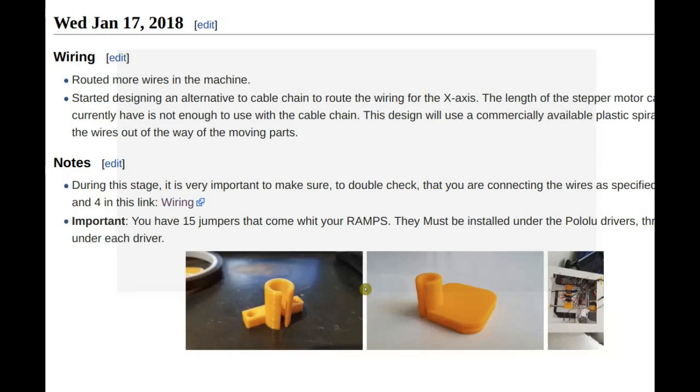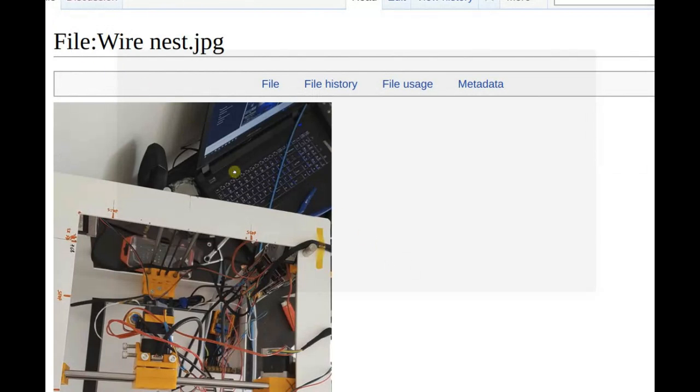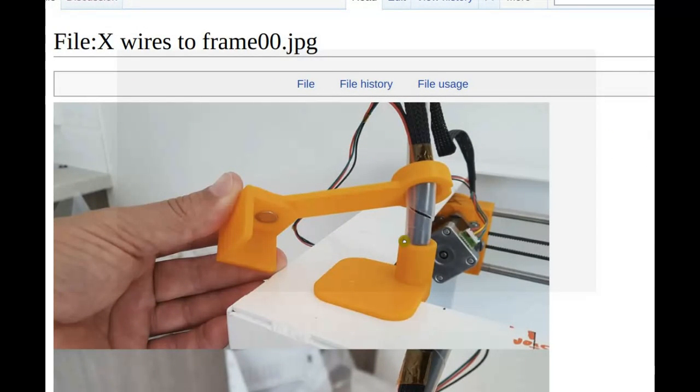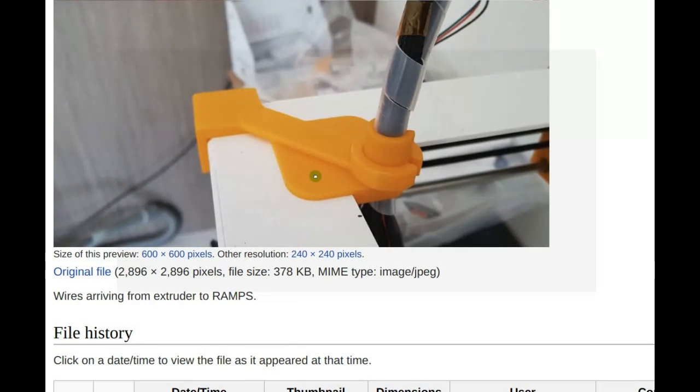If you look at those two pieces in the corner that you were looking at before, not that one you are pointing now. Well, that is part of it, but I did it as a two-piece to lock it in place. But with the tolerance that is in the corner piece, inside where the cable goes in, I don't think that extra lock is needed. Because of the way the cable sort of levers on that round piece, I think it will lock in place just by friction. It won't move because it's very tight tolerance.